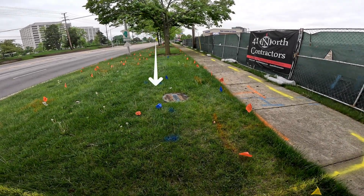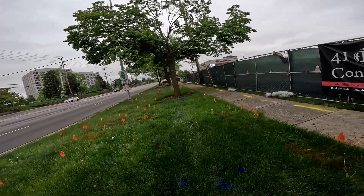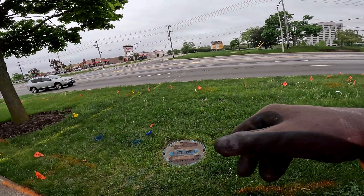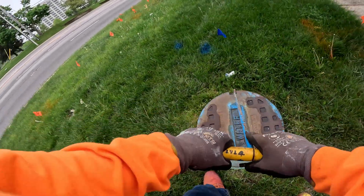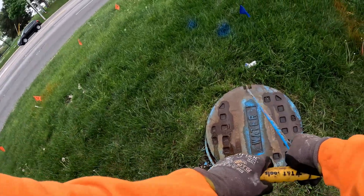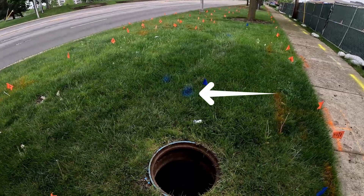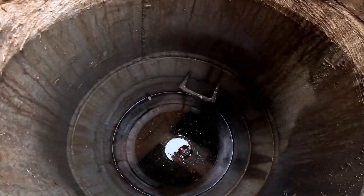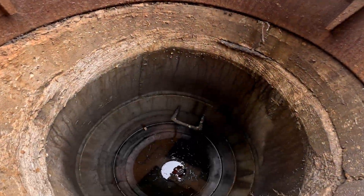So you can see where my dots are — it's laying with the water main here, but over here it's offset. So my dots are offset from the center of that lid, 12 inches. Let's go see how this main runs. There are my dots, and there's the water main. So the water main is offset from center 12 inches — this is where my dots are. So this one here is pretty close to being accurately marked with the water main.